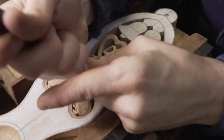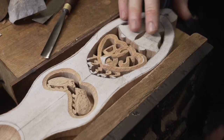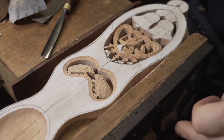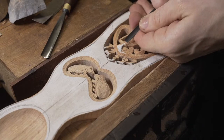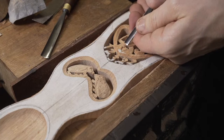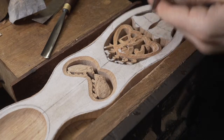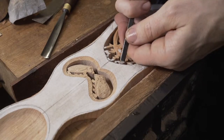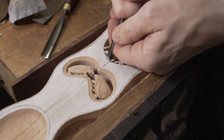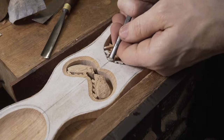We've just caught a few places with the gouge, so we'll drop the levels down on those. And what we've done in one direction, we'll now do in the opposite direction. We also have to bevel a little bit around this little mini heart, just like so. And these parts here - the bottom of the numbers and the full stops - we've got to carve them down into the wood as well. We'll shape around the outside of that part there.